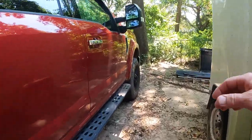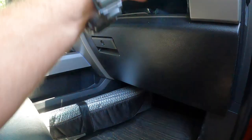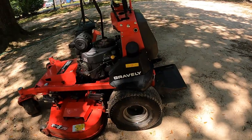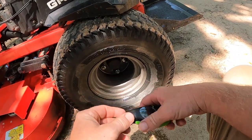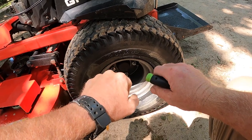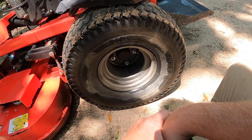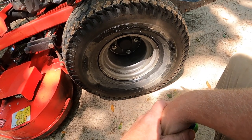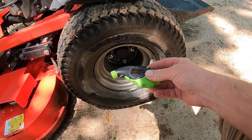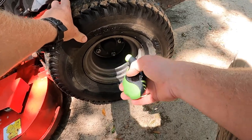I bet some of y'all know what I'm about to do. If you don't, I'm gonna show you the number one way to improve the cut on your mower — it's right here. If you don't keep the recommended amount of air pressure in the tires, the mower is going to drive crooked — you'll be pushing but one side will veer right or left because of the tire pressure. Secondly, the mower is going to cut poorly, pitching to one side. I think having a digital tire pressure gauge is the best way to always stay on top of that.